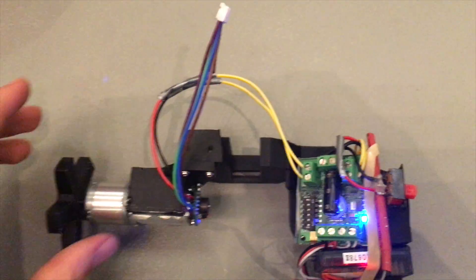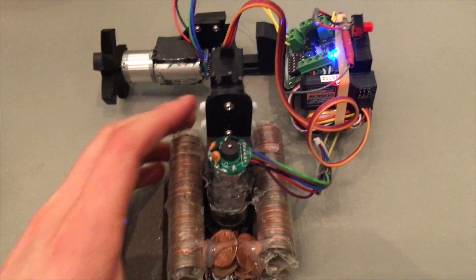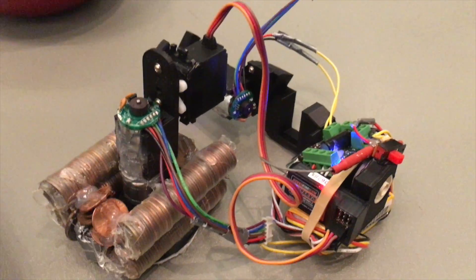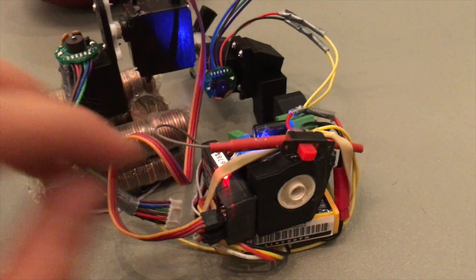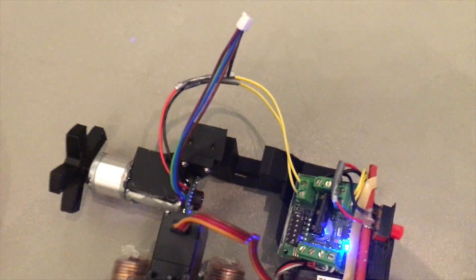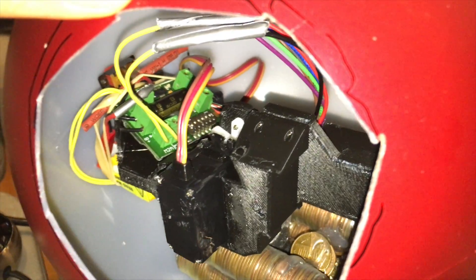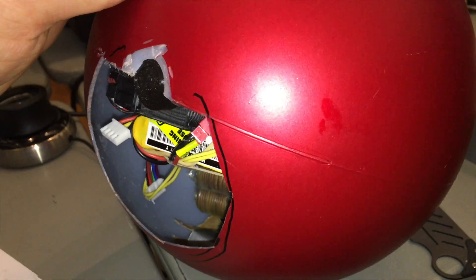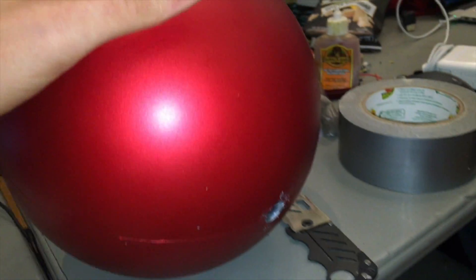I've now finished the wiring. I've got a remote control airplane receiver and a speed controller, and the whole thing is going to have to be put into the ball in two parts. I'll try to get the servo into its slot and glue it down while it's inside the ball. The servo's all wired, motors are all wired, and the power switch is on the passive edge where I'll be able to reach it from the hole on the edge of the ball. Now it's time for the hardest part of this build. I put a piece of cardboard under to support the pendulum, which let me center up the edge to glue the passive side. When I glued the active side I drilled four holes and put pins in so the hub is strongly connected to the shell.